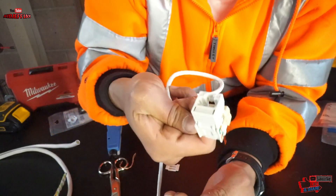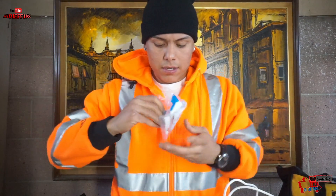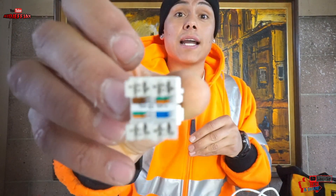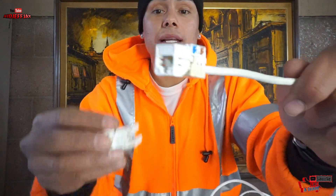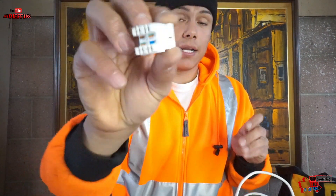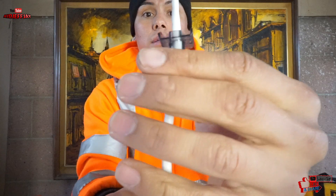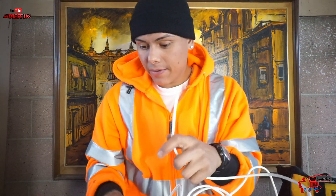Alright, so now that we finished one with Cat6 cable and the first mount jack, I'm going to show you guys another one. Let's open it. This is also with Cat6 cable and the color coding is on the inside. Remember, you got to watch out — every jack is different, they have different color coding on the inside, but it's always the same colors. First you put on the little cap inside the cable and run it like this, because if you put this first, then how are you going to close it from the back? So now that we have it inside, we just let it loose.